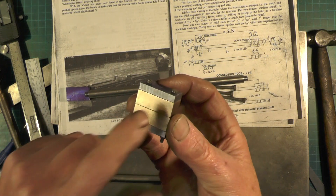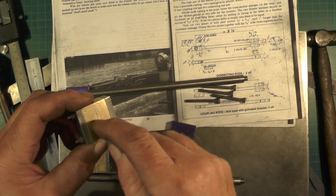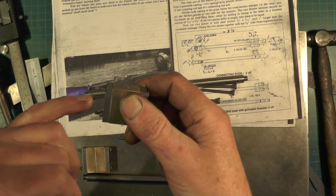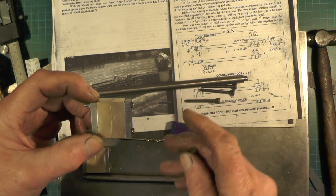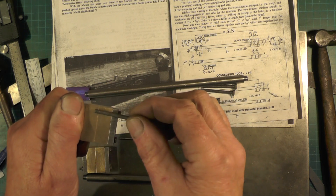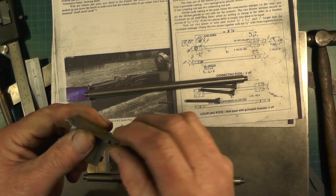Now I've got these drilled, I've put some smaller screws in and clamped them all up ready for machining that hole. These are the proper screws, so when I've got this machined I've got to tap this end 4BA where the screws are going to thread in, and I've got to open these three parts up for clearance on 4BA - not this one, these three - for clearance, so that when I screw them together it clamps up.